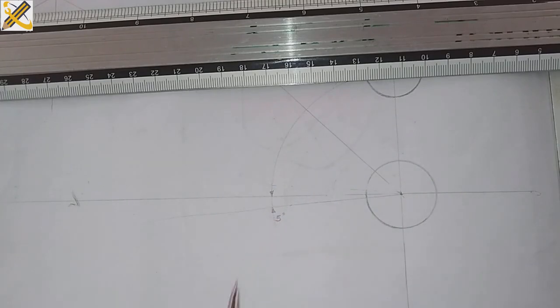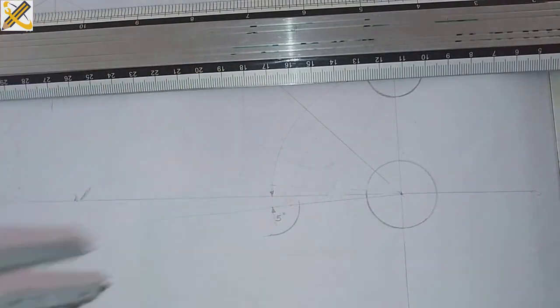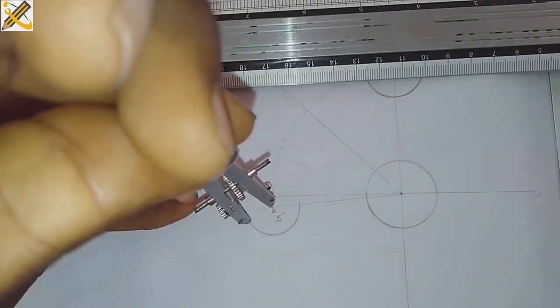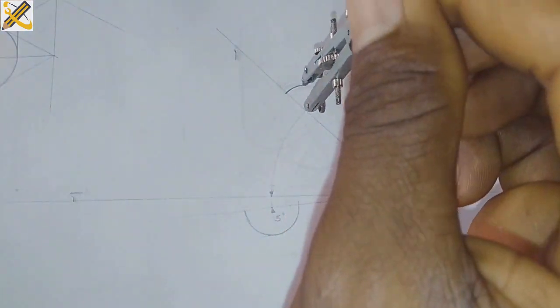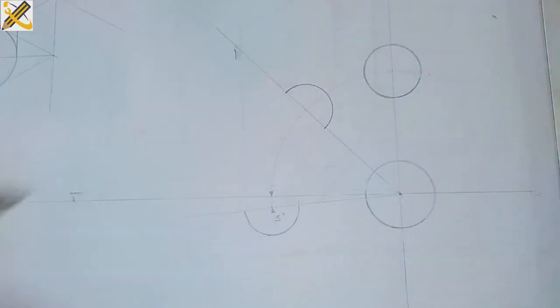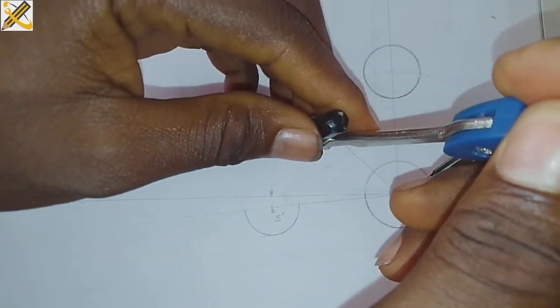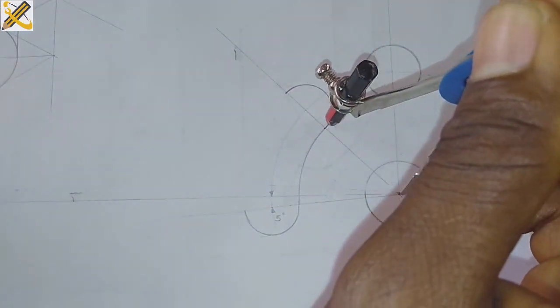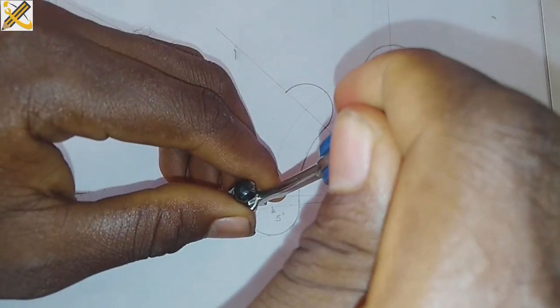Now pick radius 12, placing it here — radius 12 — I'm going to draw the first arc here. Then at the top here, also with radius 12. I pick my compass at the midpoint here, draw the arc which joins them together, then extend it to the other end and draw the second arc.